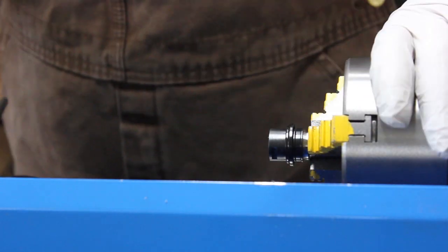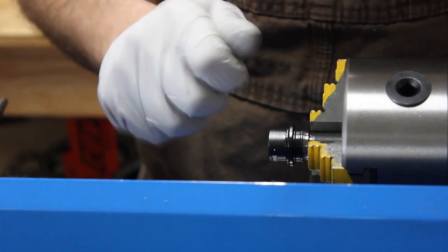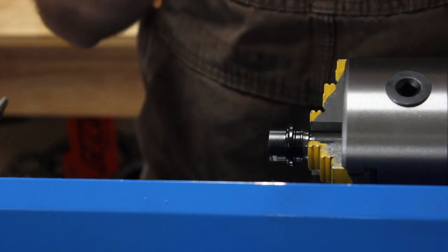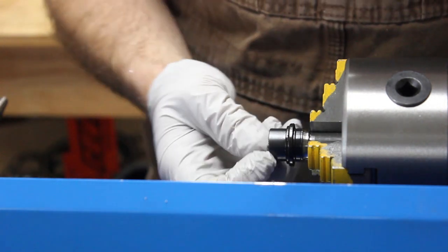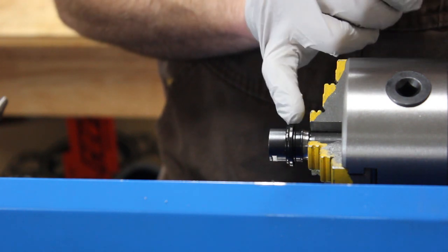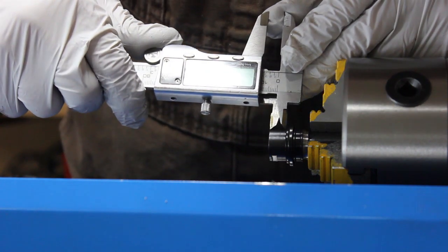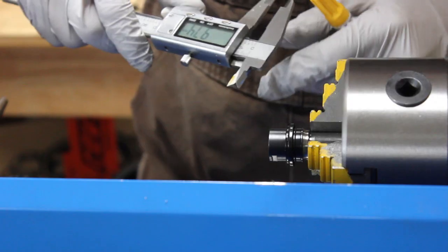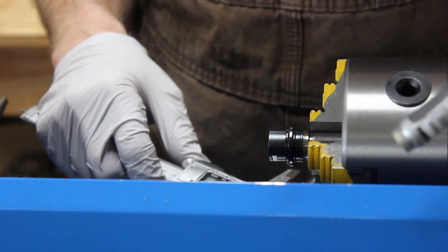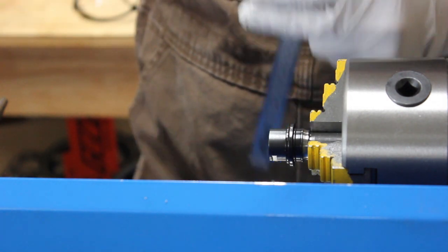I've got one of the end caps chucked up in the lathe. I actually ended up screwing it back onto the axle, tightened it up as best I could, and I'm going to cut in the rotation which will tighten it. My plan is to cut three and a half millimeters off the end, using what I think is a seal retainer as a reference point. When I measure that it comes out at right at 10 millimeters, so if I take three and a half off I need to go to six and a half. I'm going to use an alcohol marking pen to mark that line, then face it back and see how it works out.